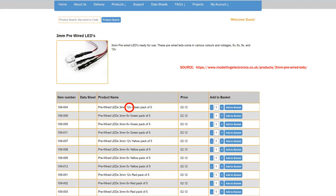We now know the size and colour, but what resistor value do we need? That depends on whether you intend to build your own or buy pre-wired. Whilst ready-made — that's a wire, resistor and LED together — are so much easier to work with, be careful that you buy ones set for your voltage. For example, you can get pre-wired set to 12V, mainly for use on model railways; the resistor in these would be larger than required and they would work but wouldn't be very bright. I've found that 9V ready-made are close enough to use with a 7.2V supply. Bear in mind that ready-made set for 6V have slightly insufficient voltage reduction and will glow brightly and perhaps not last long.